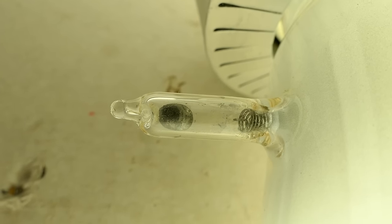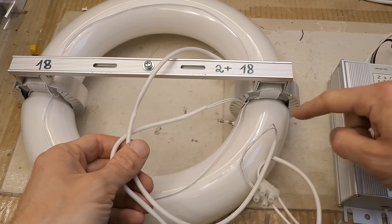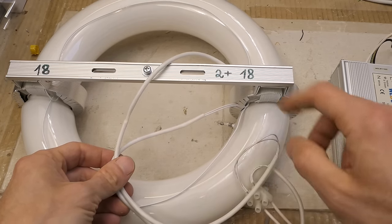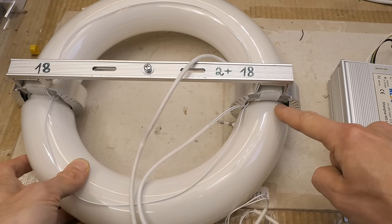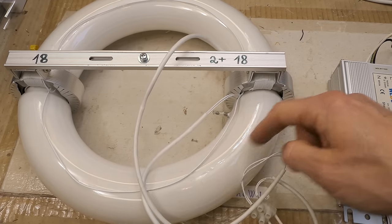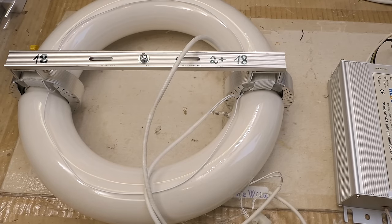Here is the detail of the evacuation stem. These coils are basically transformers where the primary is the winding and the secondary is one turn formed by the glass tube. So effectively the power supply drives 18-turn coils both in parallel, and as the tube passes through the cores it effectively makes two turns. This means the output of the power supply would be about nine times the voltage on the tube discharge — if it's even possible to talk about a voltage when it's a loop with a circular discharge, no electrodes, and no beginning or end.